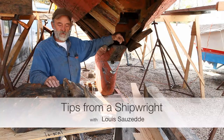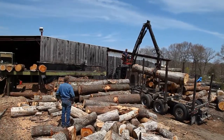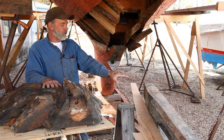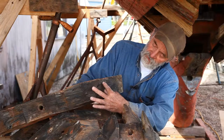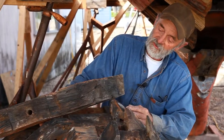We're about to go to Thompson's Sawmill and have a very large white oak log sawn to make these floor timbers, and it's also going to have this forefoot in that same log. It's quite a large diameter log. You can see that this is the center of the tree right here, right in the middle of that floor timber, and that's what's called boxed heart.